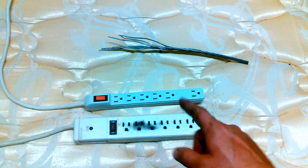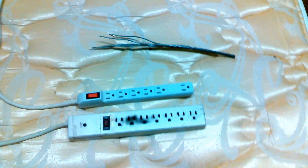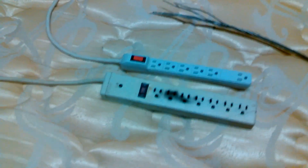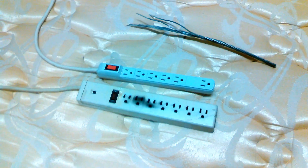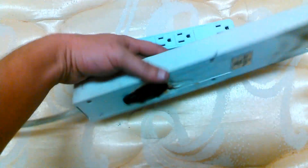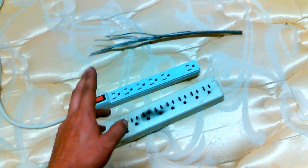There is another wire in your house you might not know about — it goes back to the pole and gets grounded. The ground is also connected to the neutral on the pole. What wire is that? Coaxial cable. Coaxial cable will act as a neutral because it's going back to that pole trying to return to neutral. So not only did four of these surge protectors blow up in my house, I lost a cat water fountain dish. This TV had a cable box connected to it with no surge protector — it's gone. The box still works, but voltage was now going through my coax cable.